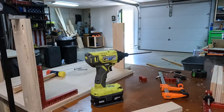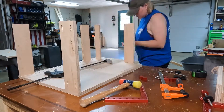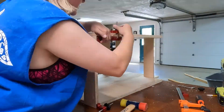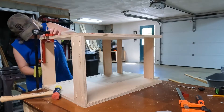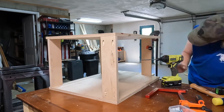In all seriousness, I think it's using these right angle clamping squares that make my assemblies go a lot smoother. Using these helped me make sure that I'm keeping this vanity cabinet square, which is going to be very important when it comes time to installing drawers. Using some wood glue and pocket hole screws, I had this vanity assembled fairly quickly.